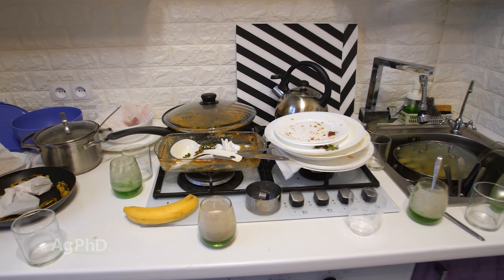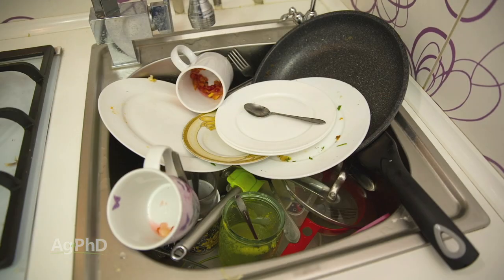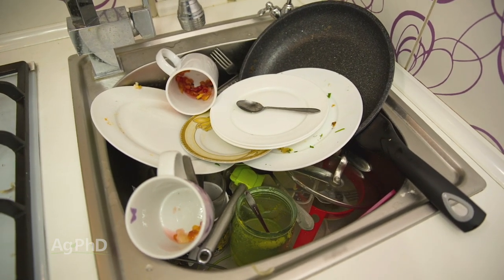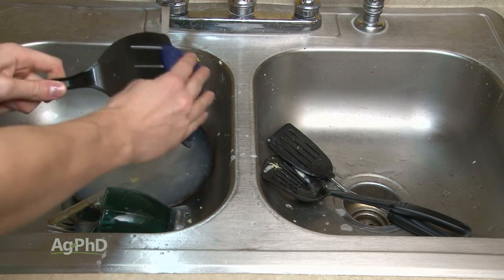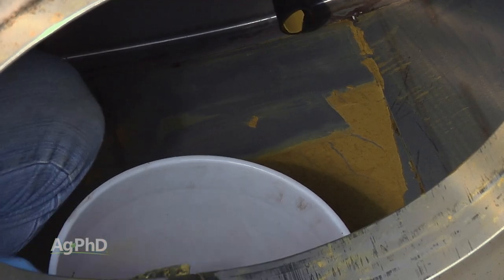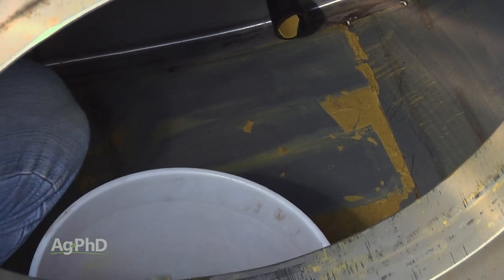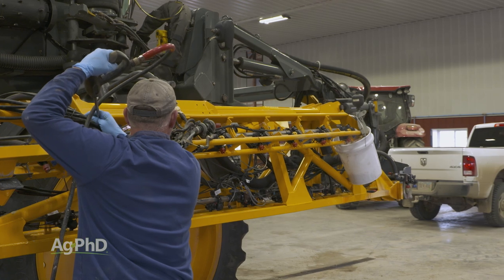I also think about this: if you've had dishes in your house and you've cooked some food or left plates sitting around, and you're taking off for the weekend without washing them — then you come back a few days later and everything is stuck on and it's really hard to scrub off. It's the exact same thing in a spray tank. When you get done spraying, the first thing to do is clean that tank out completely, because if you leave it in there, especially outside in the sun, things are going to stick to that tank and it's going to be really tough to get out. The timeliness of cleaning out that tank is very important.